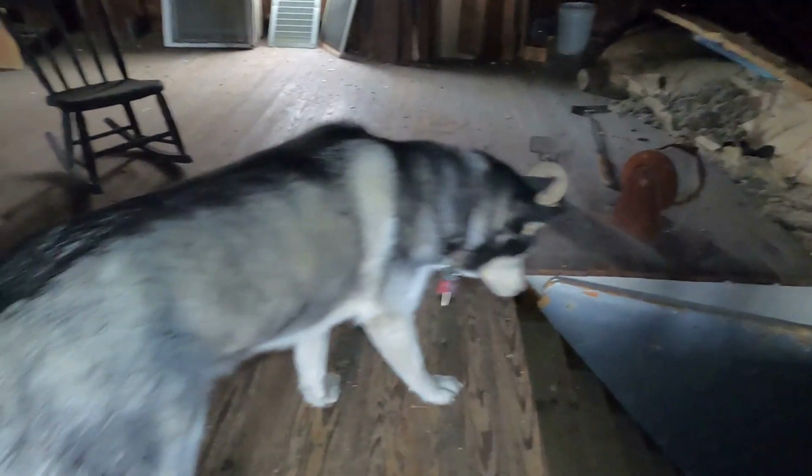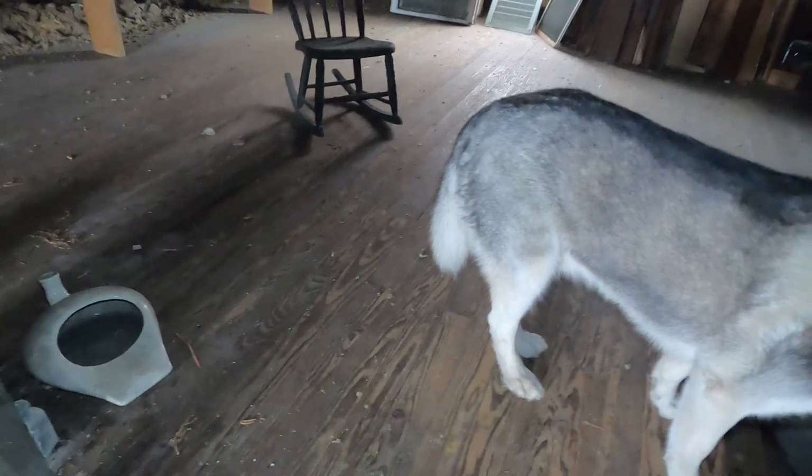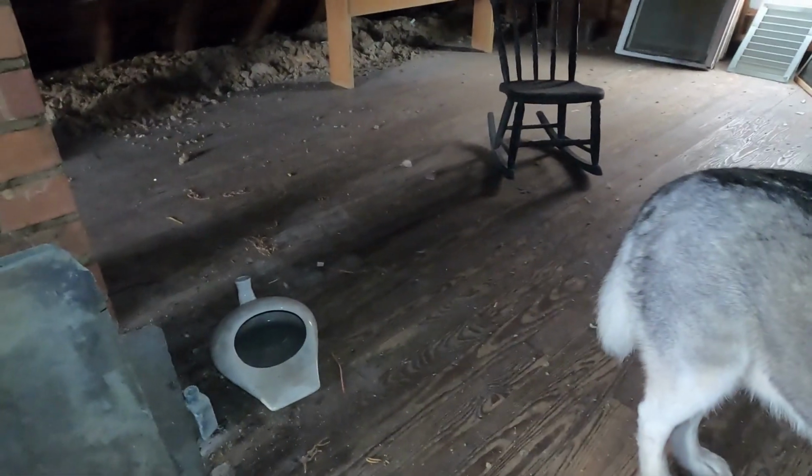I think that's it for up here. I got to get all this stuff out. And once that's done, the floor's coming up so I can insulate better up here. How thick are these floors? About 6 inches, so it needs at least another foot of insulation blown in up here. So first is get rid of the floors and put some insulation in. And I'm closing off these steps because I don't want anything stored up here.